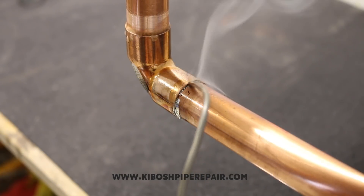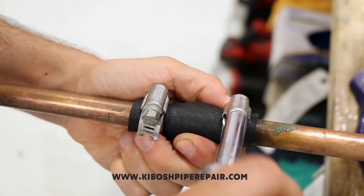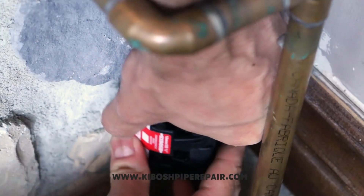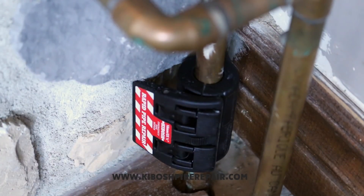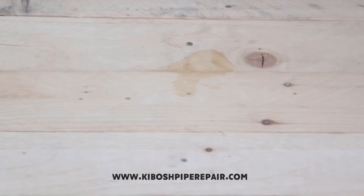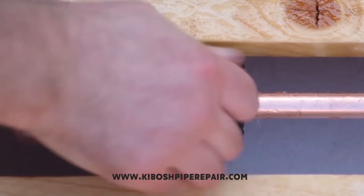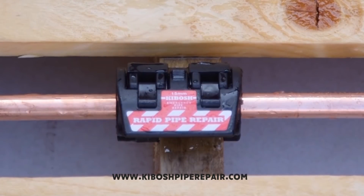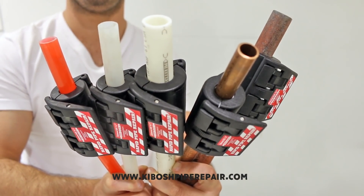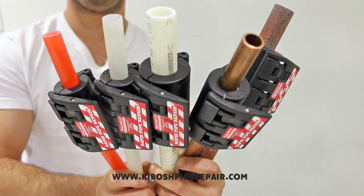There's no screwing or soldering, nor is there any clamp tightening mechanisms, which makes this gadget one of the most user-friendly damage-limiting devices on the market today. It also works well in confined areas such as this, or even on burst fittings like you see here. The Kibosh clamp is designed to fit in a notched joist just like this, so no time is wasted. The repair kit also seals multi-layer piping, PEX, PB, and steel pipes, which is great when going on service calls without knowing the pipe material.